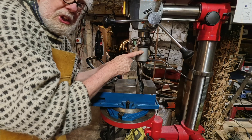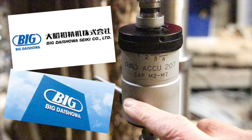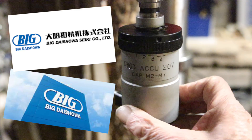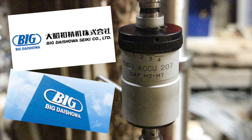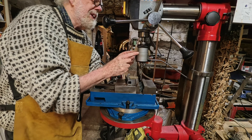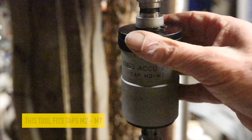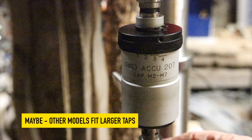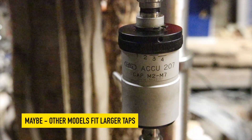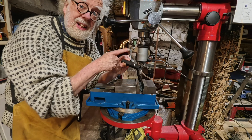The best machine I've ever come across. Made by a company called Big in Japan — I think this one dates from the 70s or 80s. Originally they would have been hundreds of dollars; this one was secondhand. If you see one of these Big ACCU 207s, get one. They're truly magic. You can adjust how much torque they cut with, adjust where it stops, and it automatically reverses. This is magic tapping.